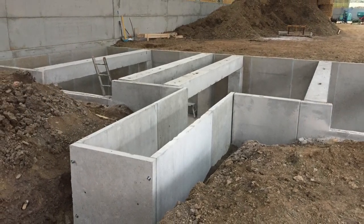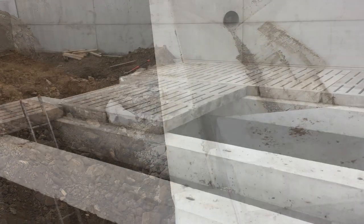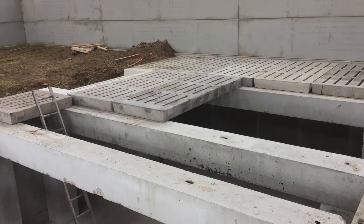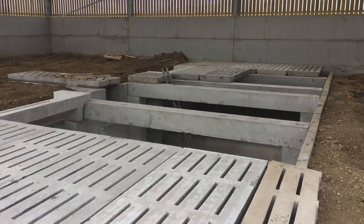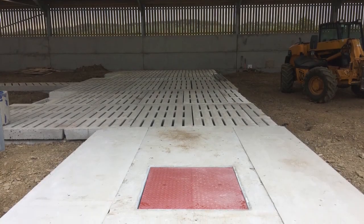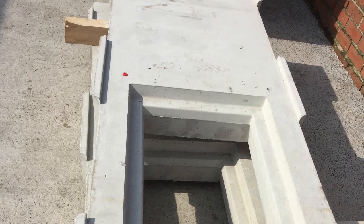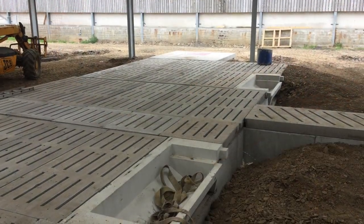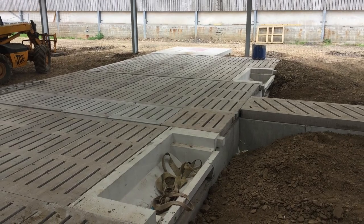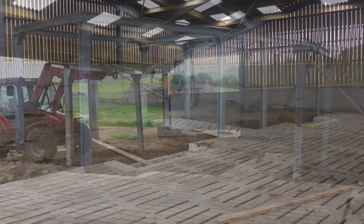There was quite a large amount of work here. The one in the middle was the separation passage — we decided to add an underground channel just to catch the slurry as the cows went through, all trying to keep things as tidy and clean as possible. Now the tank was complete, it was a simple case of lifting the slats onto the top and onto the beams. We also fitted the sumps at this stage. As you can see from the photos, they sit behind the tank and the cow stand hangs over the tank itself — it's like a free-floating sump so the slurry runs straight into the tank.